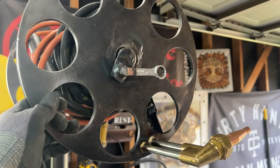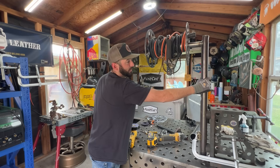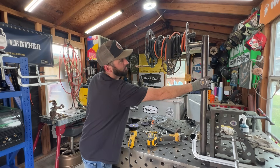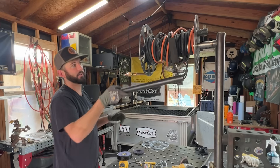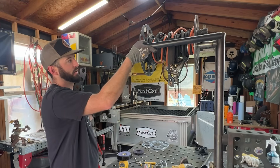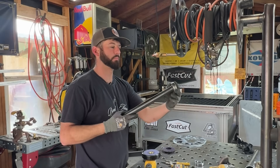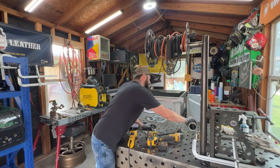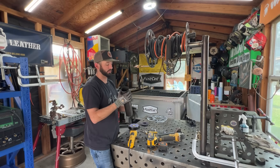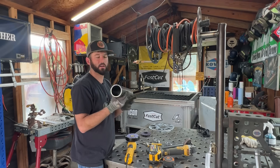We had a little scrap torch that I cut off and used as a handle — you can use whatever you want. As far as cost: this is inch-and-three-quarter tubing, roughly three feet, and then we have a piece of inch-and-a-quarter running through the center, welded to the inch-and-three-quarter post. We're going to have inch-and-a-quarter bearings run over this, along with a piece of three-inch tubing. This three-inch, eighth-inch wall tubing is about a foot long and goes on the outside of the bearings.